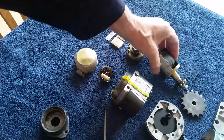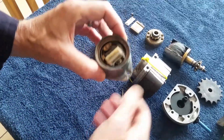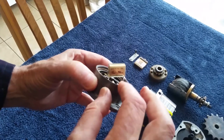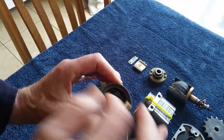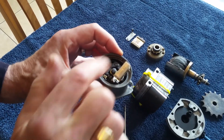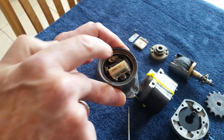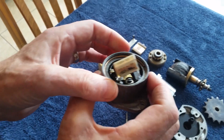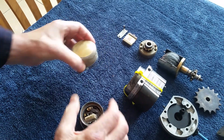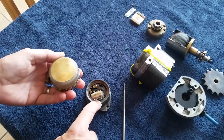One issue remains. When it's installed in the end of the magneto, the capacitor is too tall. I'm going to fold it down once I've screwed it in place during the rebuild, so it just lays on top of the screw — that'll be fine. Maybe a blob of glue underneath just to stop it moving. That gives you a height issue: you can't use the original brass cap that clips in the top because it's not tall enough.